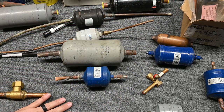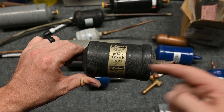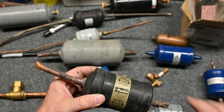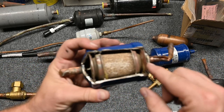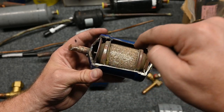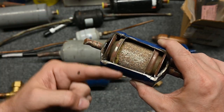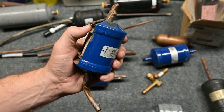When you're working with heat pumps you're going to end up with another option — what we call bi-flow filter dryers. We'll talk about these more with heat pumps, but the refrigerant can flow either direction. I know some people that keep only bi-flow 5-ton filter dryers in their service van. The cost difference between a bi-flow 5-ton filter dryer and a one-way 5-ton filter dryer is significant. The bi-flow filter dryer has these extra valves built into it on both sides. When refrigerant flows one direction, it goes through the outside of the filter dryer, into the center and out the other side. When it flows the other direction, the valves change and it goes through these valves — either way it's filtering from the outside in, keeping all the contaminants on one side.